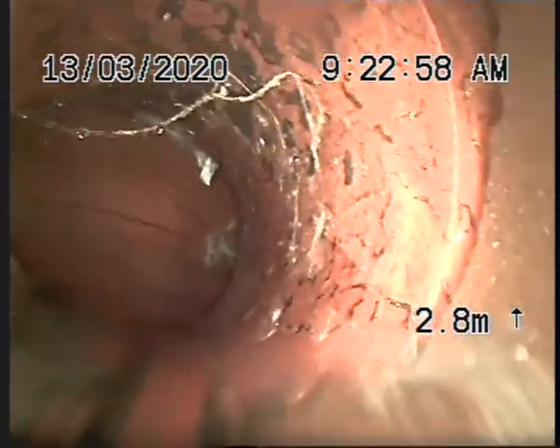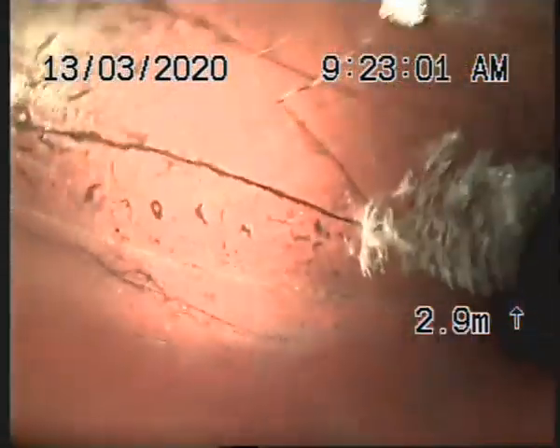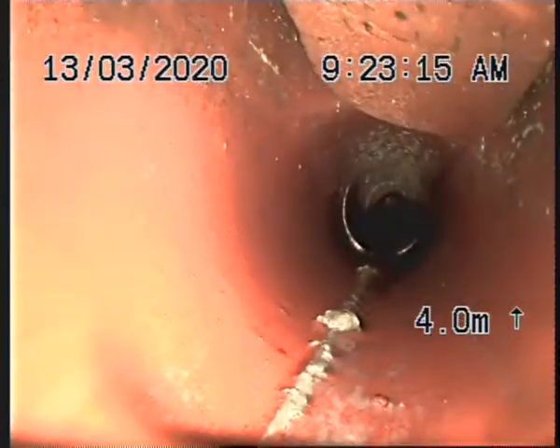So what we're looking for is the cause of a leak. We determined last time that it has to be between this top gully trap and the bends where I will stop. I'll go around the bend — I'll push as far down as I can today. So what we're looking for is a dislodged joint. We have this one here. We don't think it's this one. I do recall which one we are looking for, which is just downstream of the gully trap.